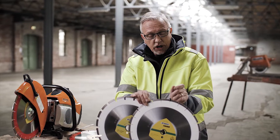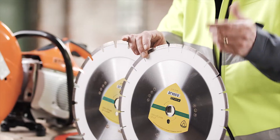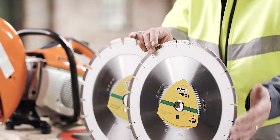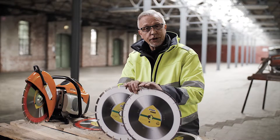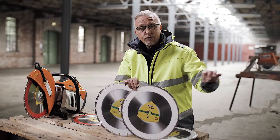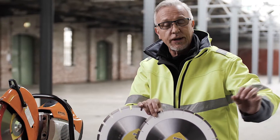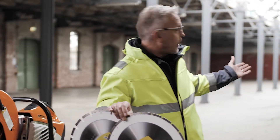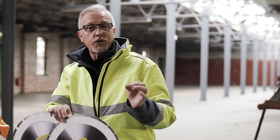When we have a very close, tight gullet like this, this allows for better lifetime — there's a bigger surface area of diamond abrasive around the disc — but also the quality of the cut: a much finer edge on terrace slabs and such things. If you want a nice fine cut and you're working on a table saw like this, then it's very important for the quality of the cut.